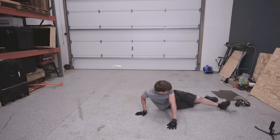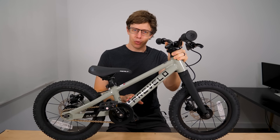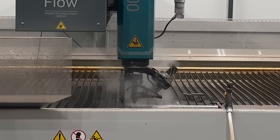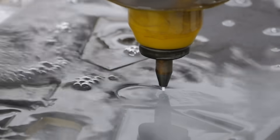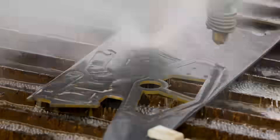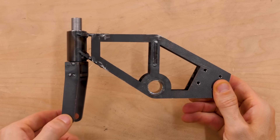Let's start at the beginning, when I thought I would be only making one bike. I want to make a tiny bike that's way smaller than this, but I also want it to be easy. My design strategy is really focused on my water jet — it cuts almost anything with a supersonic stream of water and abrasive. I'm designing as many parts as possible to be 2D shapes that can be cut out of a sheet because it's fast and easy. The different pieces have little tabs that fit together like a puzzle, and then throw on a few welds and you've got a frame.